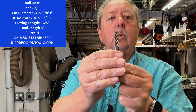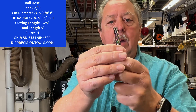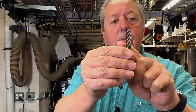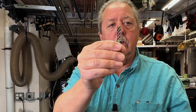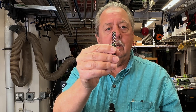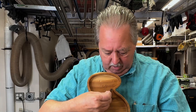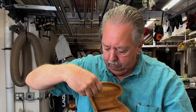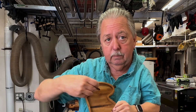Another ball-nose that I acquired later was this one right here, which works terrific. This is a 3/8-inch ball-nose, so you need to have the ability to have a 3/8-inch collet to mount this. Like the quarter-inch, it's got flutes that come up with a rounded top, which allows you to make the nice rounded shapes in the actual sides of the dish. You'll notice on this dish that the edges here are rounded, and that can only really be accomplished by either a ball-nose bit or the other bit I'm going to talk about.